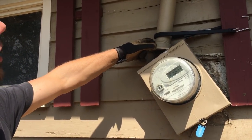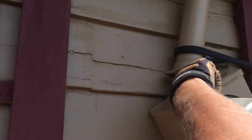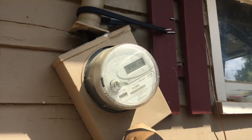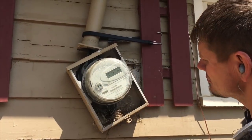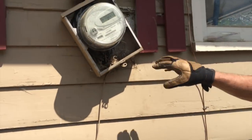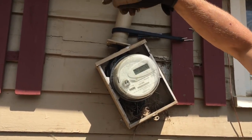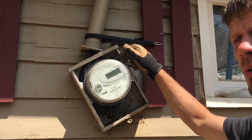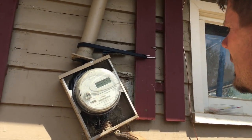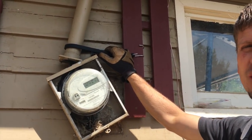This is going to have to come off and we have to redo this. You can see right in here there are leads coming in and leads going out. I had to pull all this out — there was a nest in there; I'm not sure if it was a bird or a mouse, but it was packed. You cannot use a raceway coming in for the utilities and going back out for your own private side — first because they're concerned you're tapping power for free, and second because it's usually just too much fill. This bungee cord has been there about three months while she's been dealing with the insurance company and getting bids.